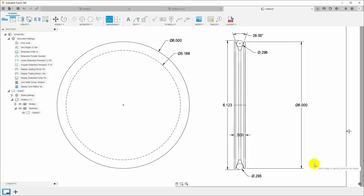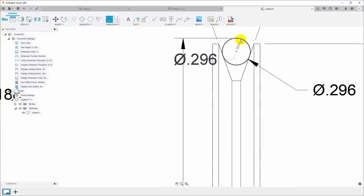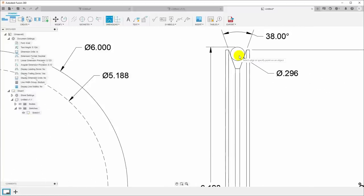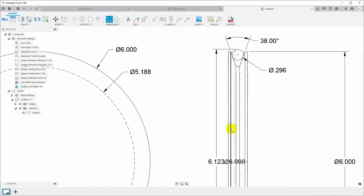So using pins like this is really one of my favorite tricks. And because you can put it in the CAD software, you can use constructive geometry rather than math to try to figure this out. I mean, you could do all the math for these angles, but because in the CAD software, I can just drop it in and say, yeah, make me a circle, make it tangent, make it this big, and then take a direct measurement off of it. The CAD package does all the math and makes this kind of stuff easy and makes it easy to produce a drawing that then makes it easy to work in the shop. So you can use the same technique for machining a dovetail or machining a V-belt pulley that you would if you were machining threads using thread wires.